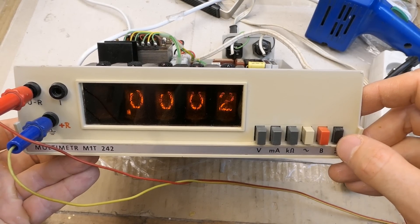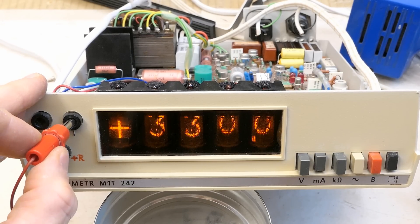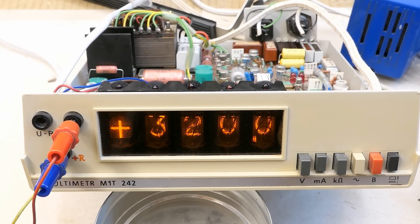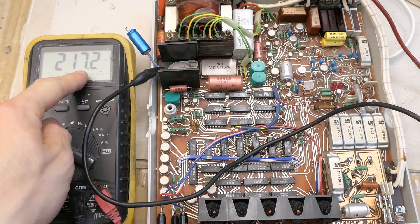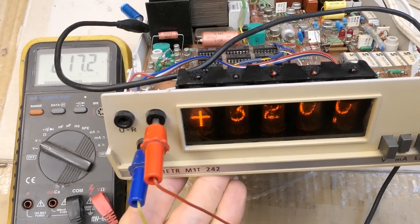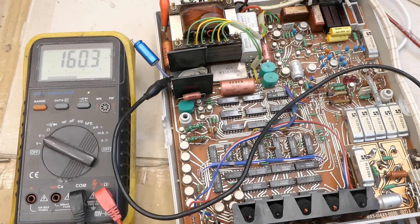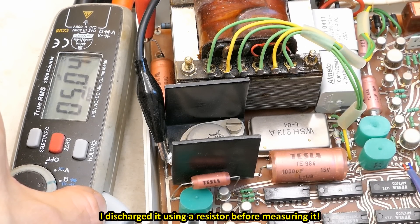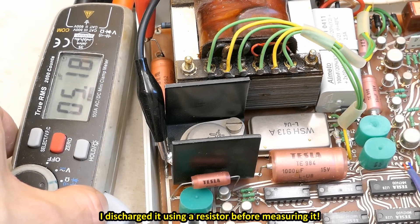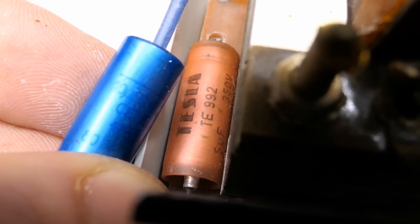Let's test it and it works. Now everything seems to be working nicely. Out of curiosity I tried to disconnect this botched-in capacitor. I was thinking the original one was open circuit, but no — it's actually smoothing the voltage nicely, with about 217 volts on it. The Nixies light up nicely and the capacitor discharges gradually. It appears it still works. The capacitor is 5 micro, 350 volts, and it can surprisingly be measured in circuit — probably because at low voltage the Nixies are not conducting. ESR is surprisingly low for a 5 micro capacitor. So I'm removing this botched-in capacitor.